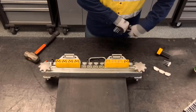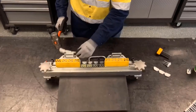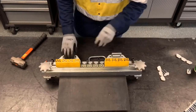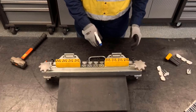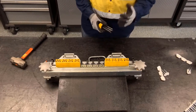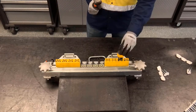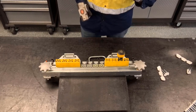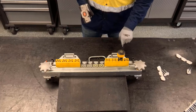I'm going to do the same on the other end. Then we're going to push the rivets down against the belt. Then we're going to spray some silicone spray, and this helps the five-prong driver and the rivets glide easier during the installation. The first hit using the hammer and the five-prong driver are the most important, because we want to make sure that first hit locates the rivet through the top fastener, the belt, the bottom fastener, and in through the MSRT base.